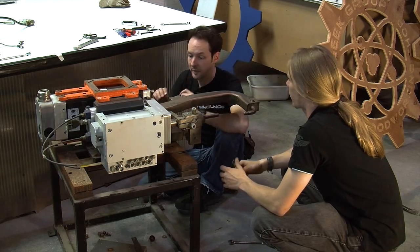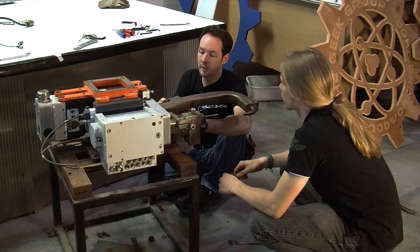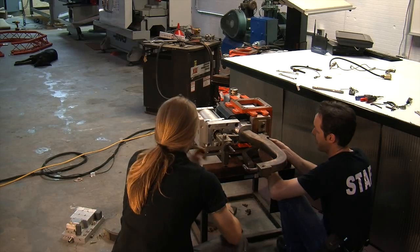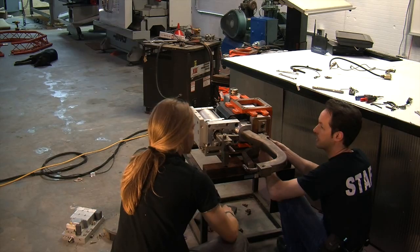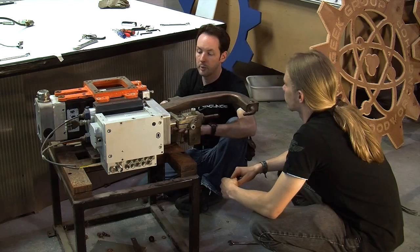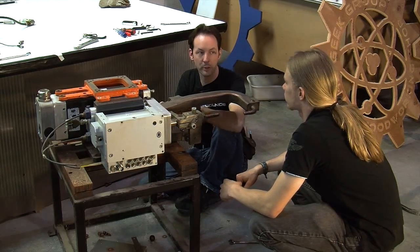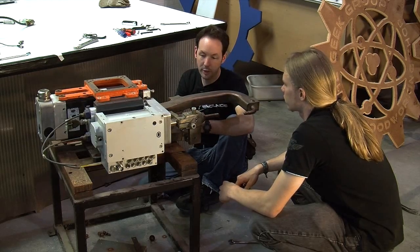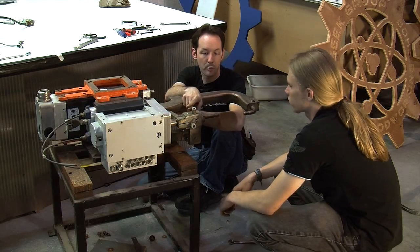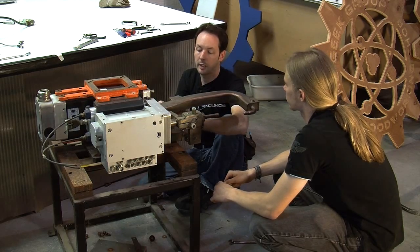With thumper, you probably have the problem of arcing at 2000 volts. Well, with thumper, it's only 2000 volts, which people think is really high, but 2000 volts won't jump a very big air gap. They've got to be really close together to initiate the arc, but you can't let them touch with our current gap, because if they touch, they weld themselves together instantly. Something like this, we can design where we can adjust the stop point really well, a lot better than we can with our ram. And I like this better.